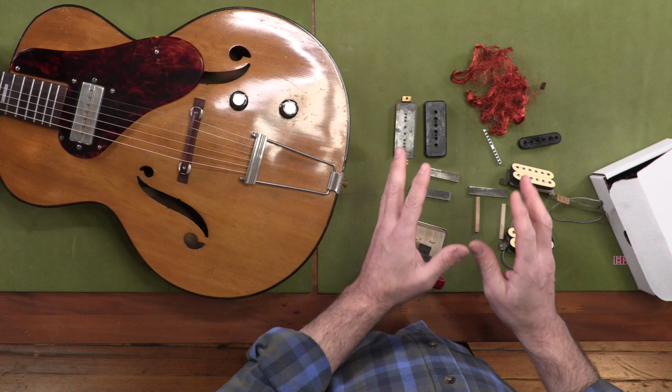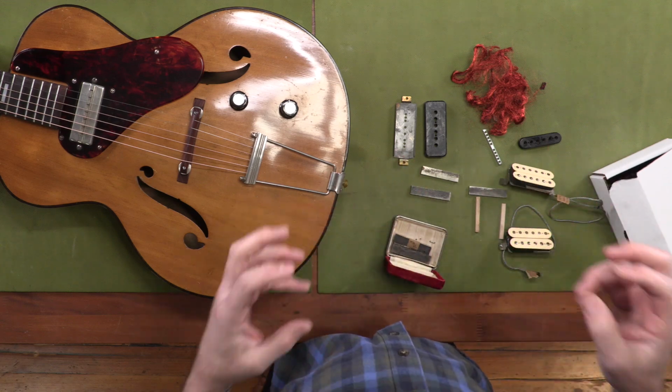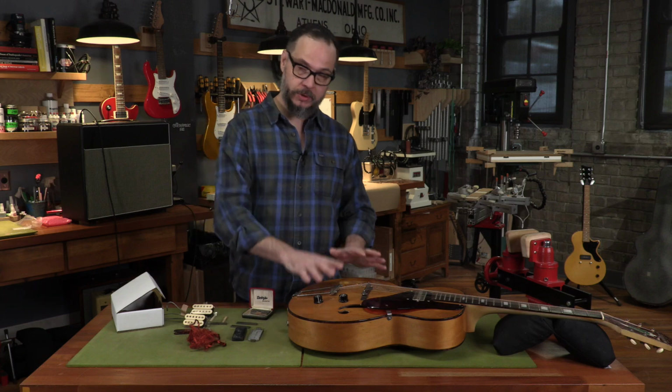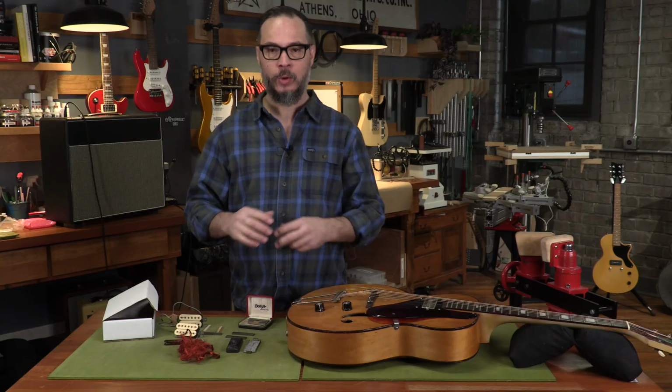You get all these tiny little components in there and certain frequencies make them vibrate. And then they can all start vibrating together along with the movement of the top to create this feedback loop that we call microphonics. What do we do about it? Well, we want to introduce something liquid deep into the pickup that's then going to be solid in another state to dampen all of this vibration.